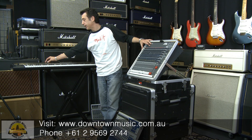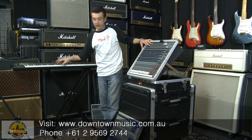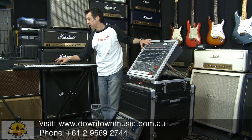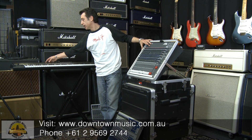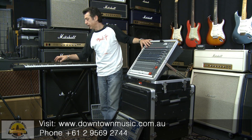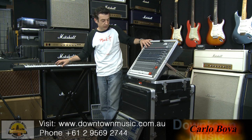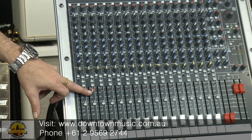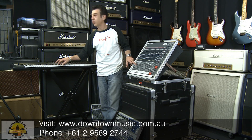What I'm going to do now is turn up the keyboard flat out and play. Watch — the red light should be on all the time. Now, that's incorrectly set up. You've got to know — the keyboard player's got to know that if he's giving you three quarters, his maximum volume at 2 o'clock on his keyboard, and that's what you've set it up for, that's got to be the maximum he plays. Because if he starts turning it up to 9 and 10, he's going to be distorting the mixer — and all you're going to get is horrible distortion coming through the PA system or onto your recording.